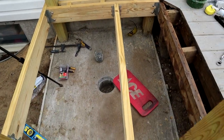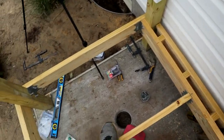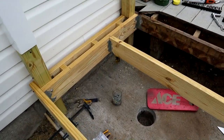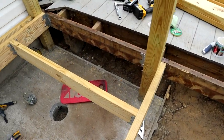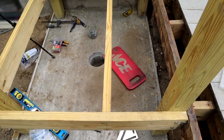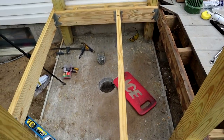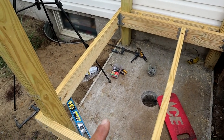And there you have it - nice secure connection. Should be able to walk up on these things now without feeling anything wobbling. I only have one left to put in. If you're building a full-size deck with another 30 of these to do, you keep doing the same exact way - keep taking your measurements, make sure everything is square and the same on both ends, put your hangers in, drive your nails, get some exercise.